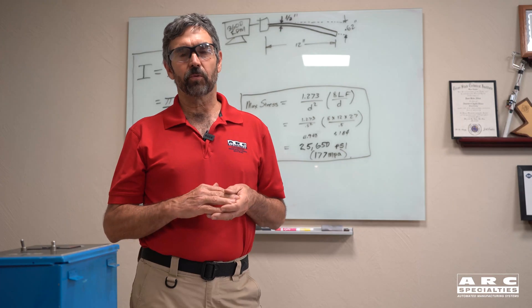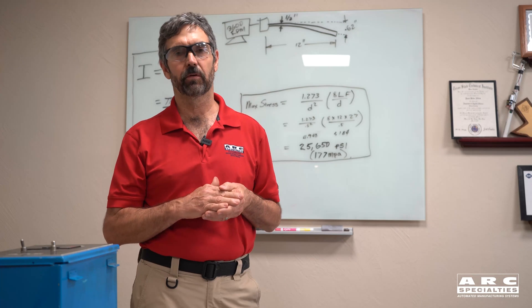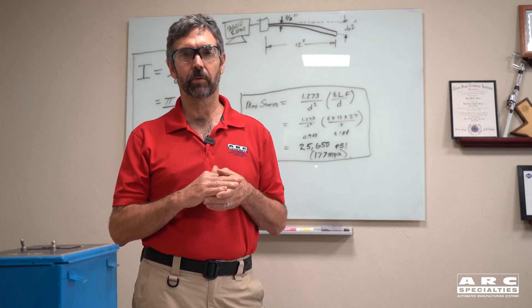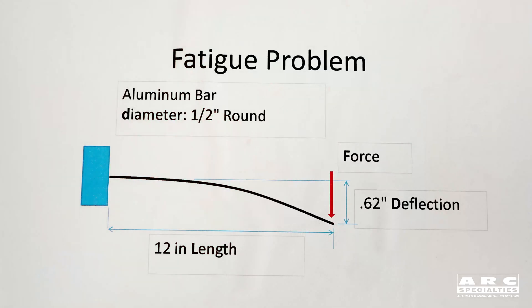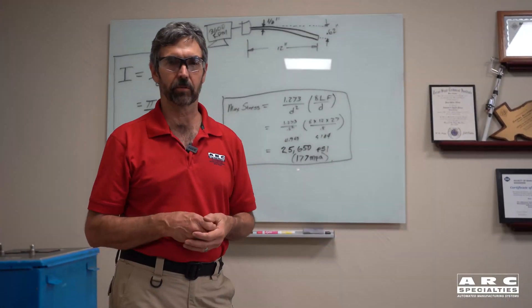We wanted to do some additional work on fatigue life. We haven't seen anything reported, so here's our first report on fatigue life of additive manufactured aluminum parts. I do a class for the local college here in town, and I started out with this question: if you have a part made out of half-inch aluminum and it's spinning at 3,600 RPM, and it's deflected five-eighths of an inch out of alignment, how long will it last? We calculate all that, and we use that same machine for this demo to test some of this aluminum.